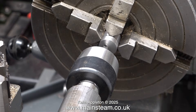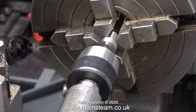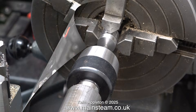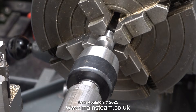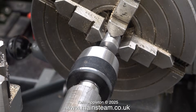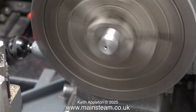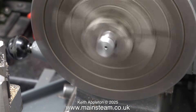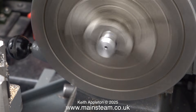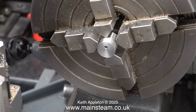The next part of the job involves drilling a hole exactly on this centre mark. Here I'm using a sort of common sense method — I'm using a live centre in the tailstock, and provided this fits precisely into the hole that I've drilled in the eccentric, by adjusting the jaws I can get this in exactly the right position. This is illustrated when I rotate it. Now that this piece of steel in the four-jaw chuck is spinning true, I can continue the machining operation.